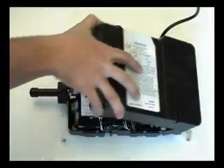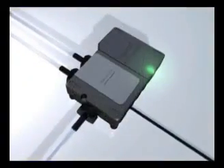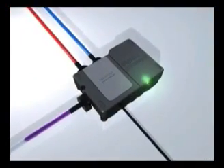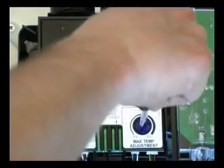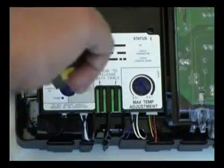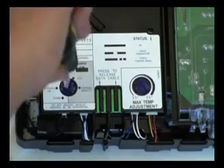We've developed a number of new and innovative features under the cover that means you can select a combination that best meets the needs of the customer and their water system. Inside are a number of controls that, with a simple turn of a screwdriver, let you adjust the maximum temperature of the water and change the mode control setting to suit the water system it operates on.